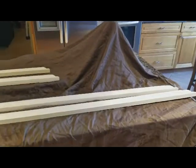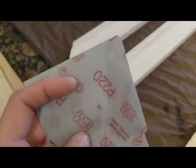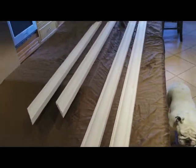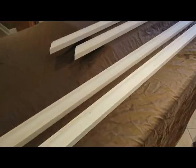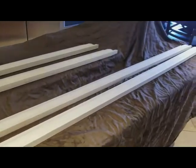I've got a very rough workstation set up with an old sheet protecting my countertop. All the pieces of wood have been cut and verified on the wall that they fit. I'm going to take very fine sandpaper and go first over the edges and then over anywhere that's not smooth. Then I'll be ready to condition the wood — that's something you apply before stain so that the stain goes on more evenly.